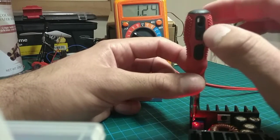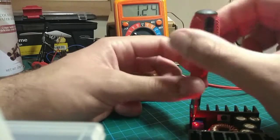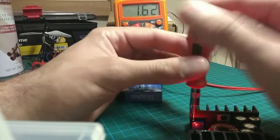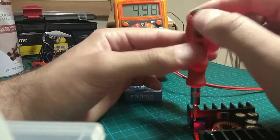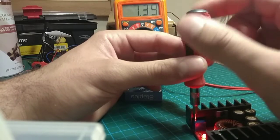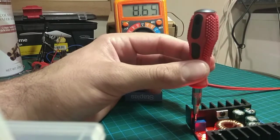The potentiometer is clicking at its limit, and the lowest voltage it outputs is 1.24 volts — close to the 1.25V spec. Turning it the other way and cranking it up, and with an input of only 6 volts, it is somehow outputting 8.64 volts.